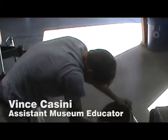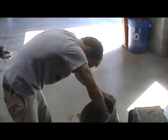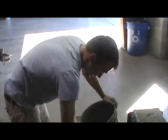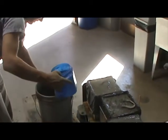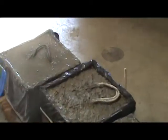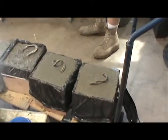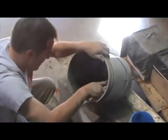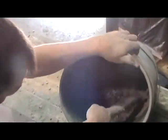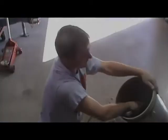So Vince, what are you doing here? I am hand mixing cement for forms that make up the component parts of our full counterweight. Each of these forms is 9x9x9 and we are mixing cement to fill them. Once they dry, they should each come out to around 70 to 80 pounds. That way, when we have all of them put together inside the counterweight basket, we can adjust our weight from a total of over 300 pounds to anything we'd like by removing them one at a time.